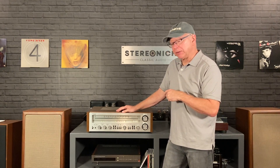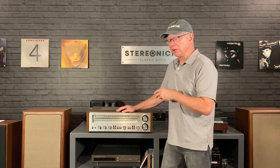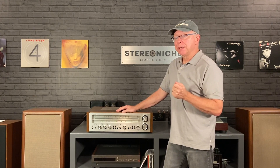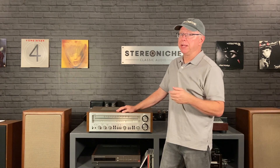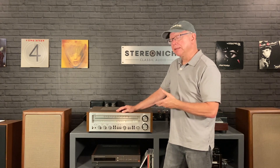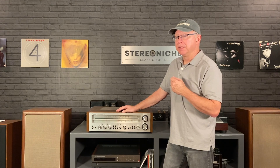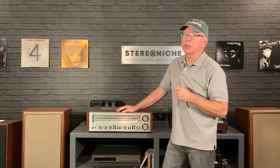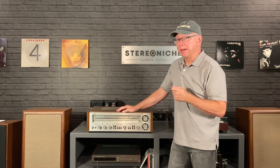In particular — and this goes for all manufacturers but very much so on Technics — is the tape monitor switch. The tape monitor switches get a lot of oxidation and the signal does not pass through. I've had some where it was so bad I thought the receiver was dead. I couldn't get anything out of it, and lo and behold, after enough cleaning it started coming through. It was the monitor switch in those cases. So spend a little extra time on that particular switch.